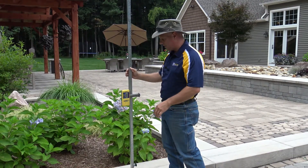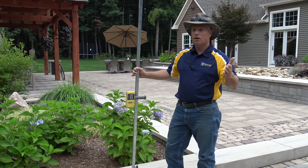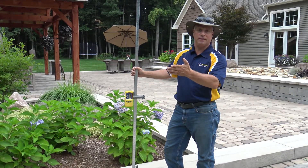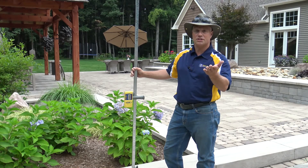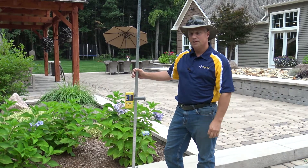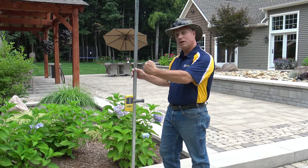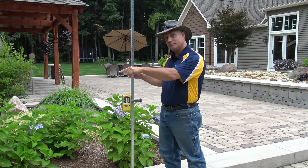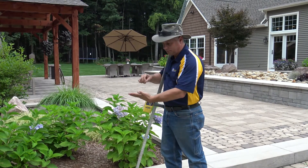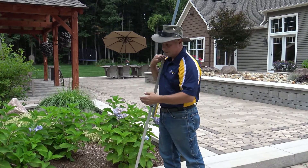Today I want to show you the ease of use on a pool patio. Say I have a pool patio and I'm going out 15 feet. ICPI recommends 3/16 pitch per foot — that's about 1 inch per 5 feet — so that's generally my standard. Going out 15 feet off my pool coping, at that point it's going to be minus 3. I take my plan and write right on there: grade minus 3, and I circle it.